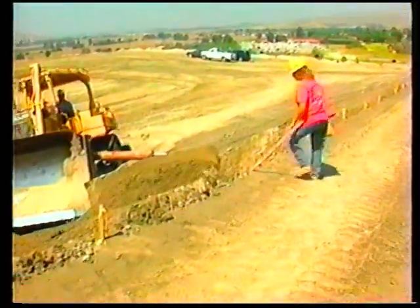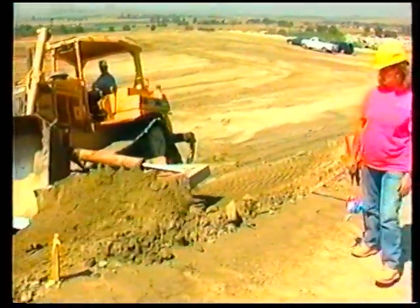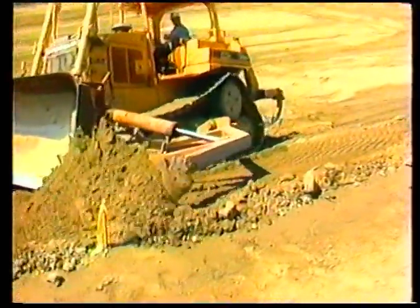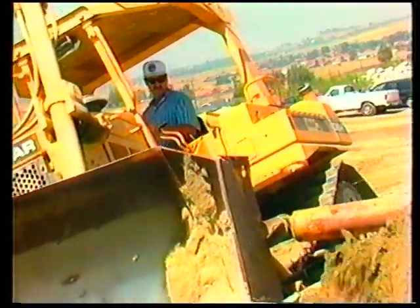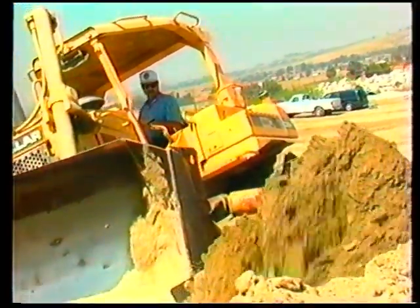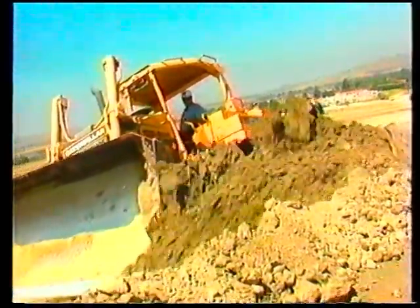Align the dozer so one half of the slope board is hanging over the end of the slope. Using the whole slope board will pull the machine to the left as the machine is dragging down the slope. After this is done, use the slope board control and lift up the slope board about halfway. Continue back up the slope, turning parallel to the slope as the machine gets closer to the top.